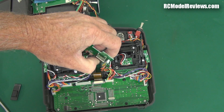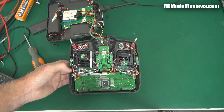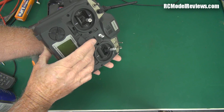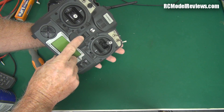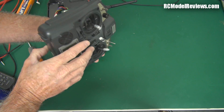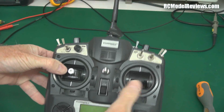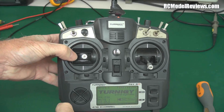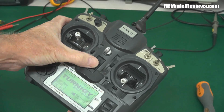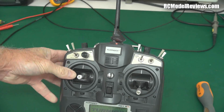I'm pretty sure that will have solved the problem. Now all I've got to do is screw it back in. Make sure you put the switch in the right way up because it's got 'on' marked on it — if you turn it around the wrong way, your switch won't work as marked. Put the back back on the transmitter — and now the moment of truth. Will it turn on? Yes, of course it does! And that switch is now very, very much more reliable than it was.